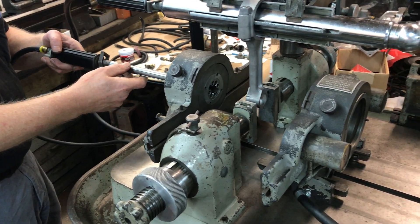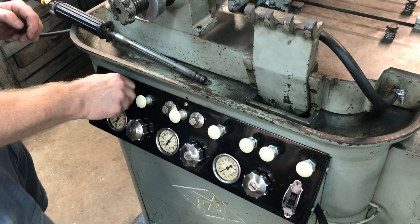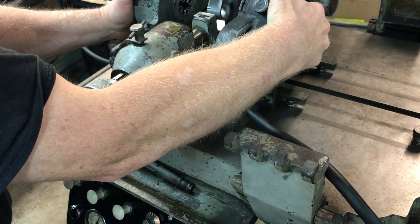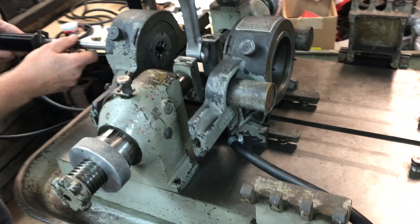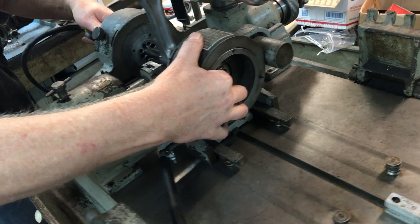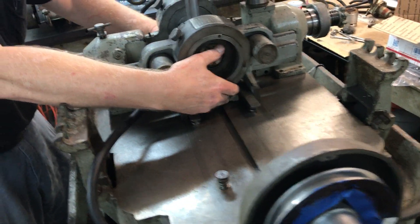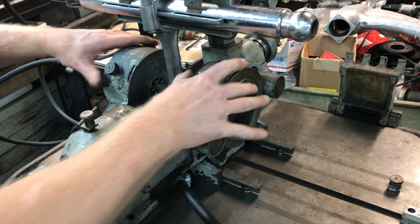Take this mandrel that can fit in the center. I'm going to turn on our other air here — I think this one was our table lock, so we've locked those down and that doesn't move. Then we'd take our connecting rod centering mandrel and go through the bearings, watching to make sure we are going through the flats.